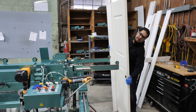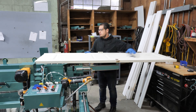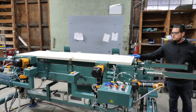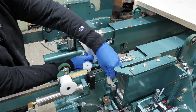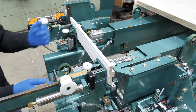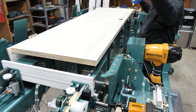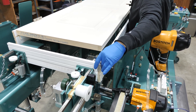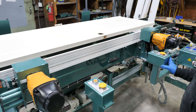Now that we have our door width set correctly on the machine, and our jam width set correctly to 4-9/16, we will bring in our door and we are able to roll it in — just like this. Now we would place our head jam clamp here. This can be done before the door is rolled into place. Now that we have our head jam in place, we can bring in our strike jam. We will place it in here, rest it on the shelves, and make sure these are butted up square.